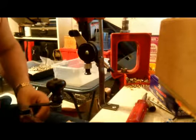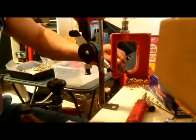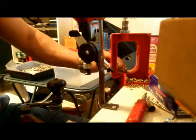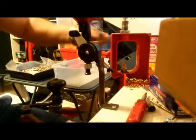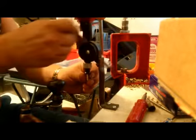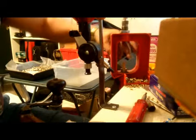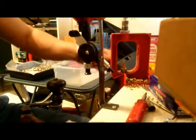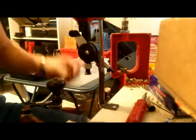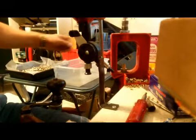Now the bullet sits in there real easy because part of prepping our cases was widening the mouth of the shell. The shell has a flare on it, so the bullet is able to sit without falling off, making it easier to press in. The final step will be the crimp, where we'll run it through a die. It'll press the shell around the bullet, giving it a real tight, snug fit. And it also helps the bullet load easier when it's cycling through the gun.